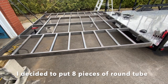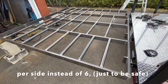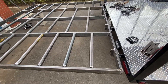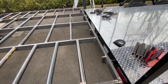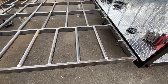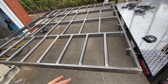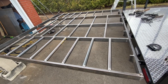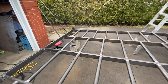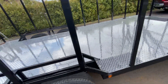The main inside of the door is complete — pretty much all tacked together. I put one-and-five-eighth round tubes and they're flush with the surface here, so the one-eighth tread plate aluminum is going to come over this. I added a little extra support on this side because this is where the buggy is mostly going to be driving, and I put some supports in the middle just in case I need to load a tractor or anything like that. I also put a bracket for the winch over there.